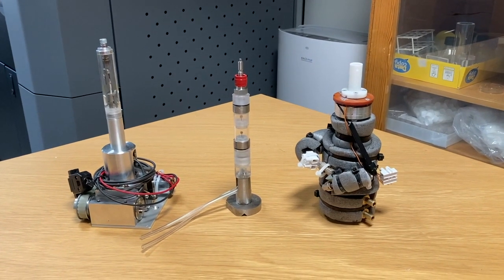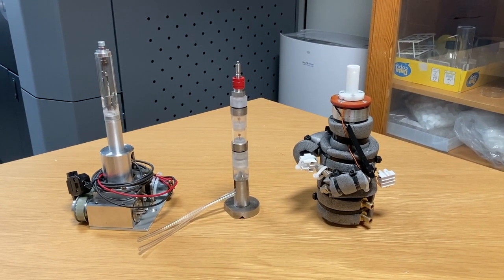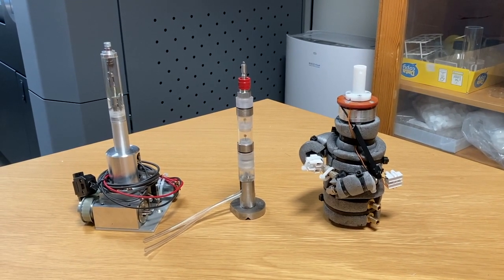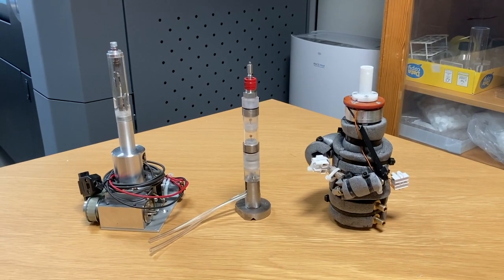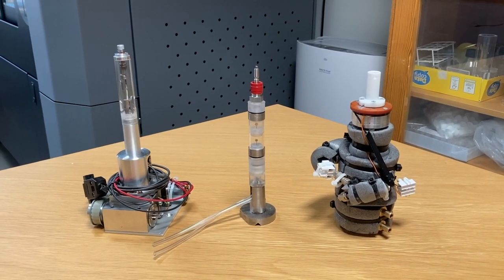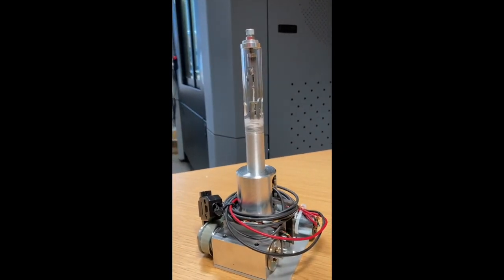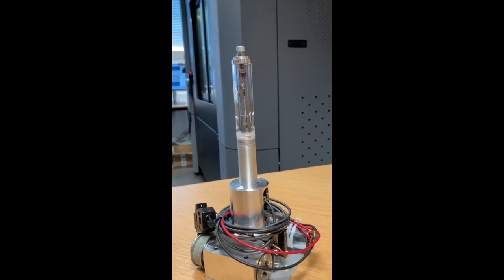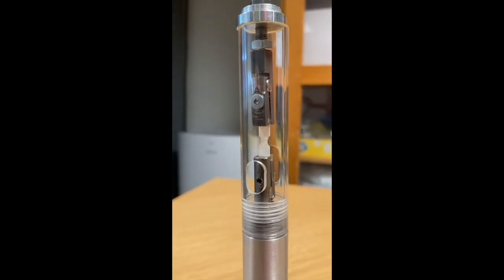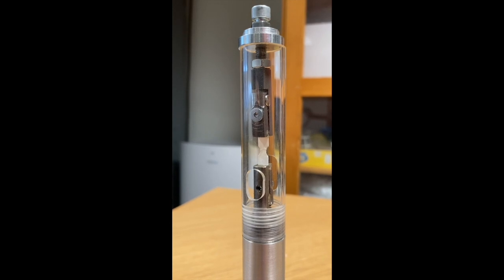As the name of the lab suggests, the major part of what we do is in-situ testing under different environmental conditions. These are three of our test cells: on the right you have the freezer allowing temperatures down to minus 20 degrees Celsius, in the middle is a pressure-based humidity cell allowing very high relative humidity, and on the left is one of our standard devices for mechanical loading. This device can be placed in the tomograph and we also take it to synchrotron facilities. Here it's set up for tensile loading of paperboard, but we also use it for compression and other mechanical loading, taking images as samples deform.